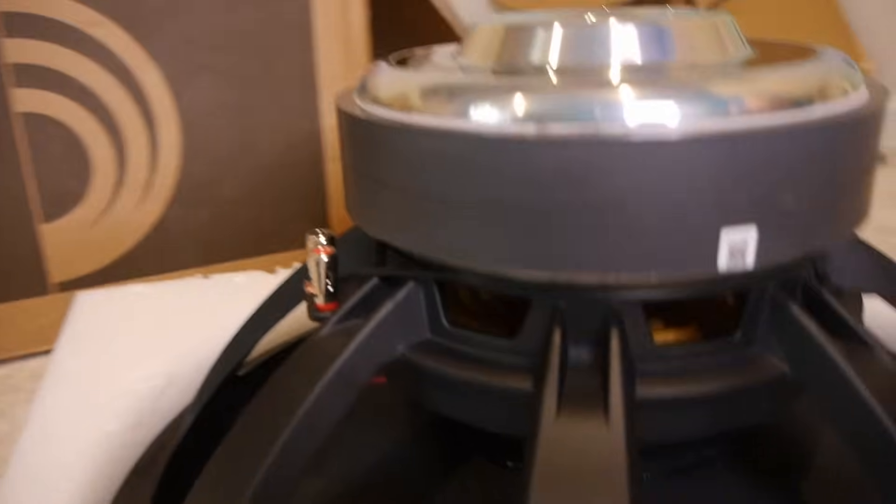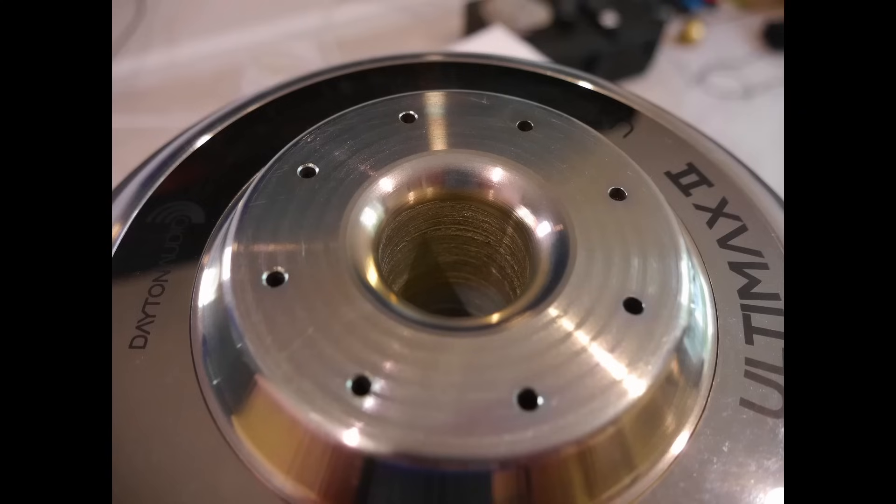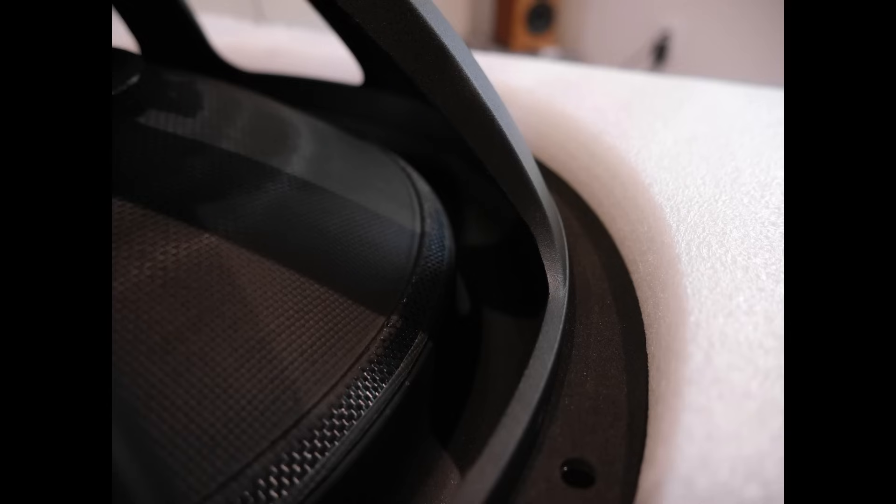The plates are polished. It's got dual spiders — you can only see one, of course, but they're in great shape. The push terminals are maybe the least fancy part; I'm not a big fan of push terminals, but they seem to be on every high-end subwoofer. There's a little machining marking down in the pole piece, and everything's ventilated nicely. They polished the back plate but not the pole — I'm not going to mark them down for that. There's no stitching on the surround-to-cone, which makes me a little nervous, but it's all very nicely glued with no drips. You can have a sneak peek of the voice coil — there's just one little bit of glue visible. With the build out of the way, let's take a look at the measurements.